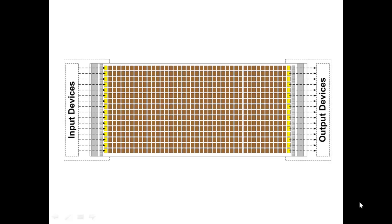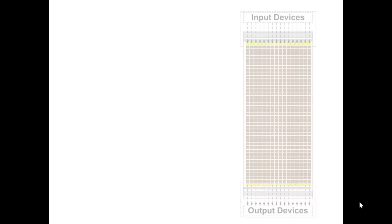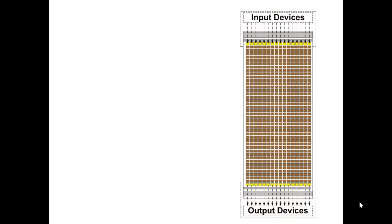For the sake of illustration, we have enlarged the panel and increased the number of rows to 16 rows of relays. Next, we will rotate the panel to conveniently give us rows of 16 relays, and we will pretend that we have 8,000 rows of 16 relays. Actually, in computer land, 1K is not really 1,000, and 8K is not really 8,000. You will see why later when we talk about the binary number system. For now, however, we are pretending that we have 8,192 rows of 16 really small relays.